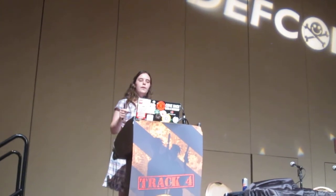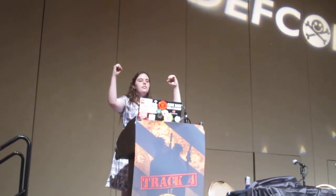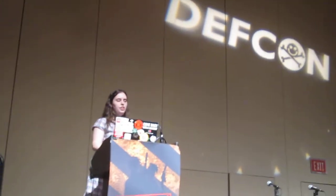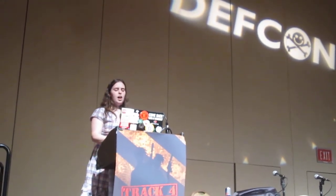So you need to make things adjustable. If you have a sprocket here and a sprocket here, this needs to be in a slot so that when the chain stretches, you can just jam it back and bolt it in again. It's much easier than all of the alternatives that I've seen that make people really miserable.